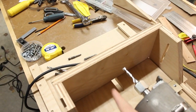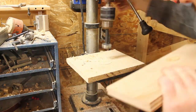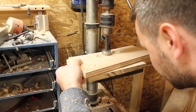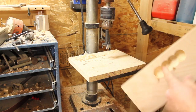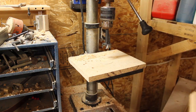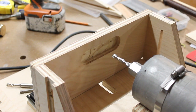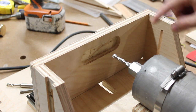As you can see I had two little marks here and here, so now I know where the start and stop of the hollow is going to be. Now I'll just clean that up with a chisel. Alright, as you can see I got this all hollowed out now, which is going to give me that little bit extra depth of cut. And I'm going to go ahead and mill my first slot.